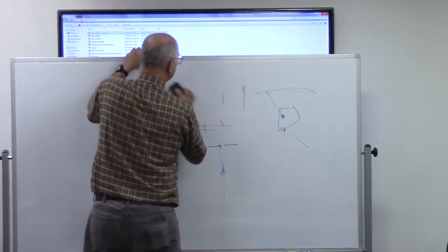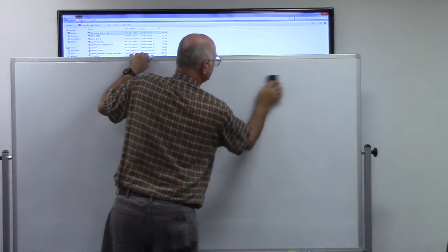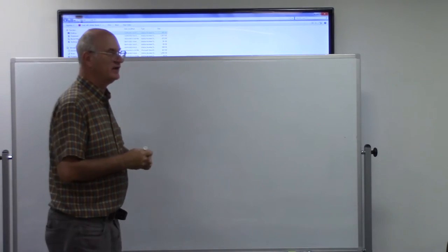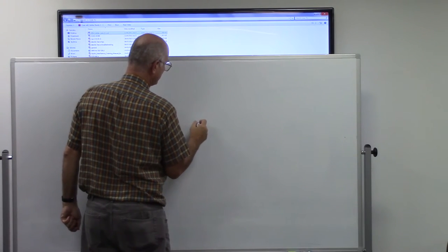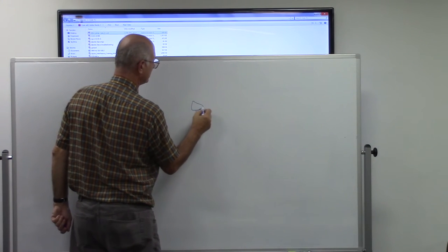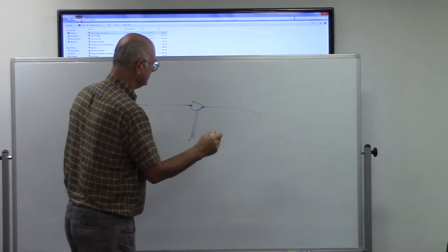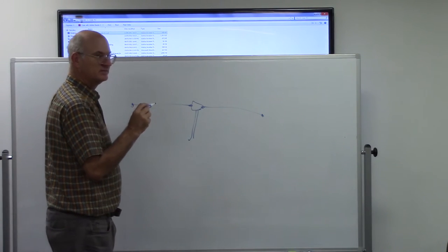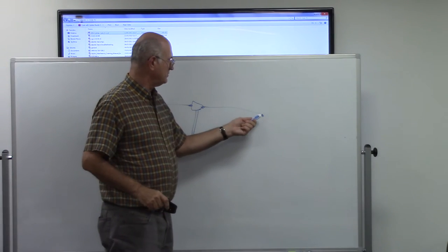Another concern that you will run into is try not to put your antenna systems down where people can get a hold of them, because they do put out some pretty nasty side effects. Basically, your basic dipole antenna, you have your feed line, your insulator, and you have your two lines. The voltage that can be produced at the ends when you're transmitting, at even as low as 200 or 300 watts, can be in the thousands of volts.